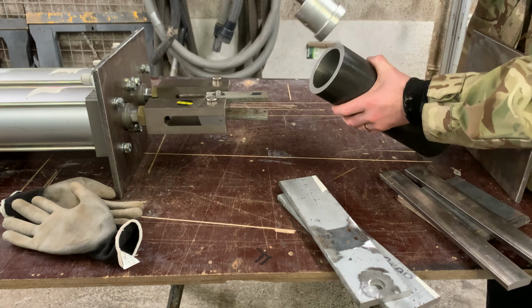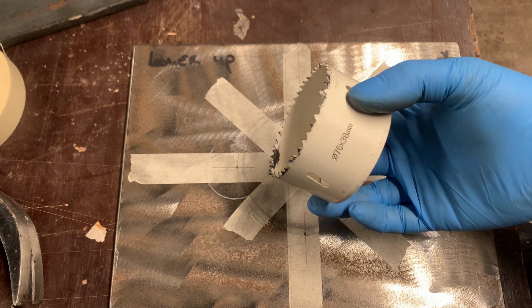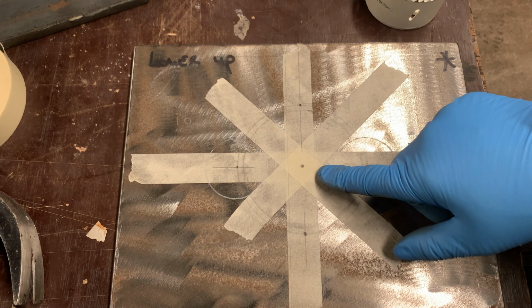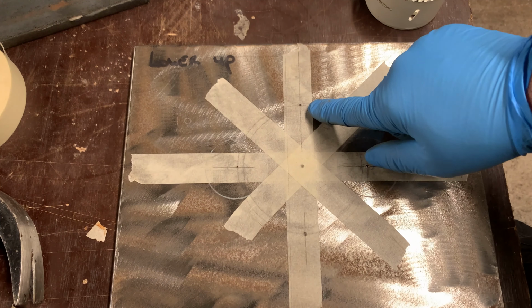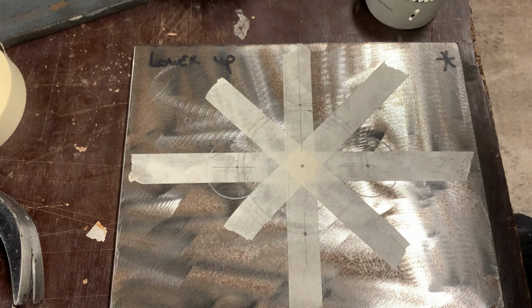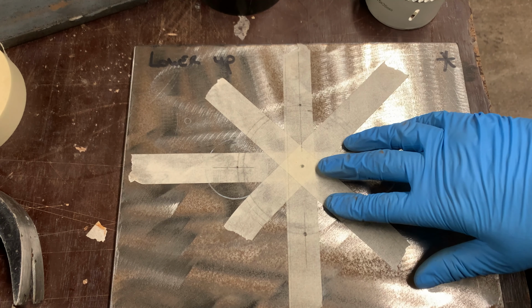Now you saw earlier, this goes chombling around on the surface, so it might not be too bad, but I'm going to give this a go. Ideally, one a couple of mil bigger would be great. I haven't got one of them. This will work. So I'm going to take this over the pillar drill now. Drill a big hole out, then drill these four out. I'm going to tap them so I can wind in a bolt there to give a 10 mil stud. Then this should just fit snugly inside.